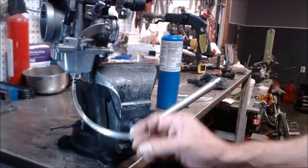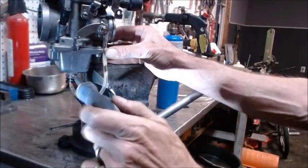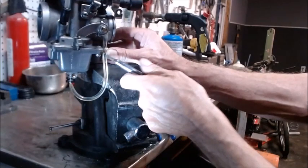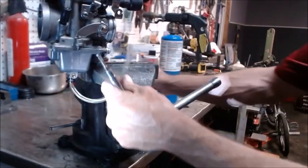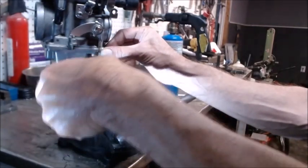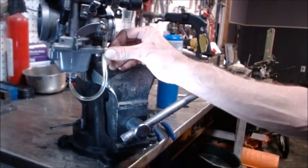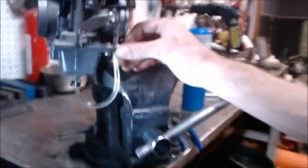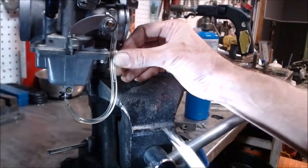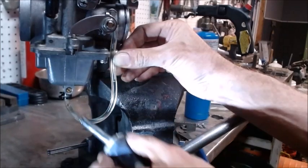There's no fuel in it right now, so we're just going to hook it up and see where it floats to. When I open it up and let fuel in, fuel comes around, bubbles come up, and it came pretty close — just below the line. But we got some bubbles trapped in there, so let me take it out and do it again. You can see there's a bubble right there and it goes all the way up. See what it did — that bubble dropped the fuel level down, so you would mistakenly think your fuel level is there. That bubble is important.